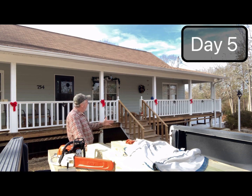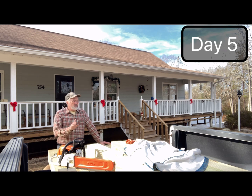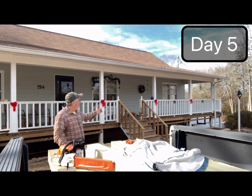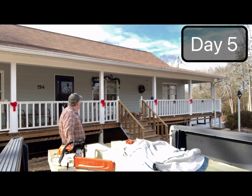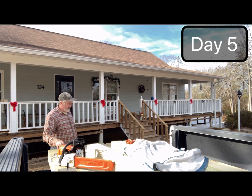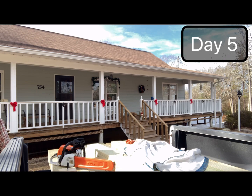4 feet out, I'm making a planter bed for whatever, flowers, bushes, or whatever. So there's a 4 foot bed, and I'm thinking to come up another level over there, but I need to work on this end. So I went and got 8 more 6x6s by 12 foot, and then I used the 8 footers, cut them in half to do the flower bed to come out 4 feet. So, see if I can get some more done on it today. I would really like to finish it up today and tomorrow, although today is already over half gone, so we'll see what happens today. I'm going to switch to time lapse, and it'll go by in a few seconds for you.